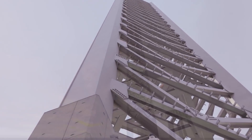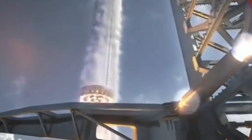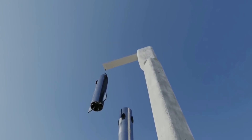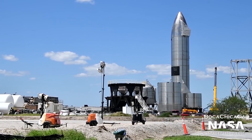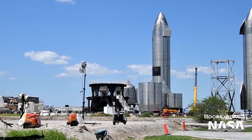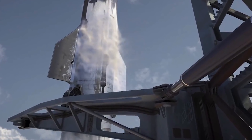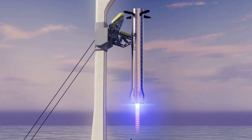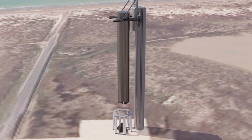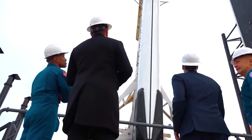The ship would also sport something that could flip out from the leeward side — Musk added that maybe it's part of the forward flaps, but probably not. The booster will slide out to line up with the orbital launch pad, ready to fly again, thanks to tank tread on the arms. The launch tower arms will theoretically be able to reach down and grab Super Heavy from a SpaceX transporter, lifting it onto the orbital launch mount. The main arms will then drop down, grab Starship from another transporter, and raise the 50-meter rocket around 100 meters off the ground to install it on top of Super Heavy, once the quick disconnect arm has swung into place and grabbed Super Heavy's interstage to secure it. After that, the QD arm can link Starship to the pad systems.